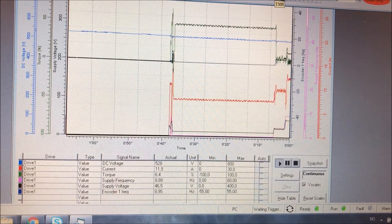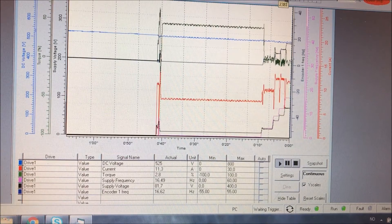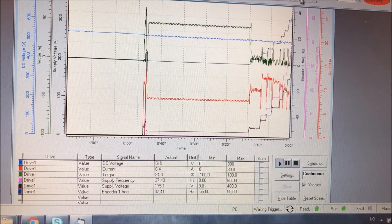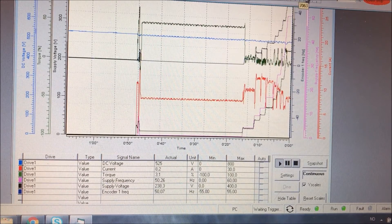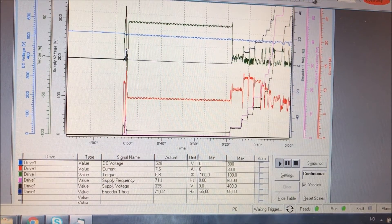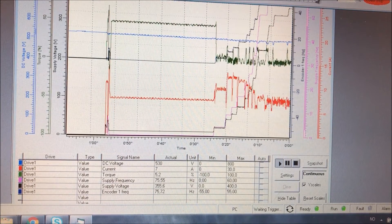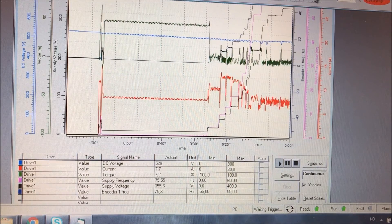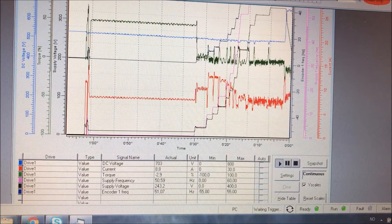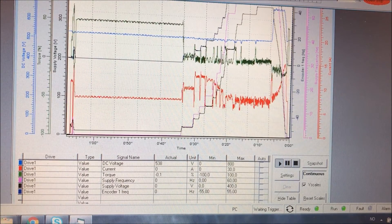This is open loop in a nutshell — we over-magnetize the stator to be sure it is able to hold the magnets. We make sure it runs nicely and I want to run at quite high RPM to see that there is no vibration and no mechanical problem, because the identification run will also be at quite high RPM. I want to know that it can actually do this in a controlled way.